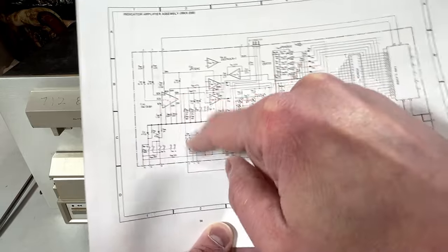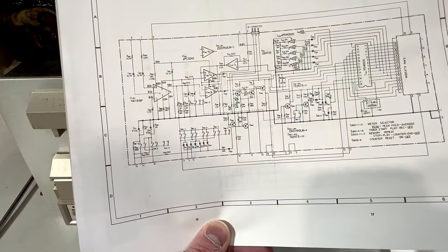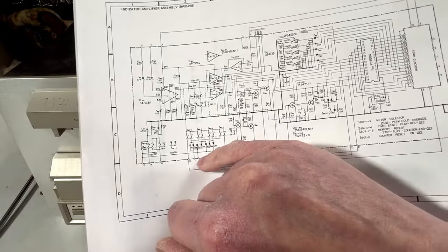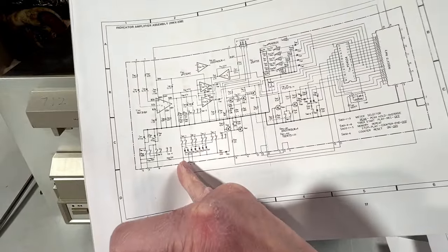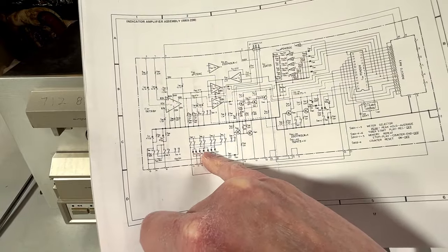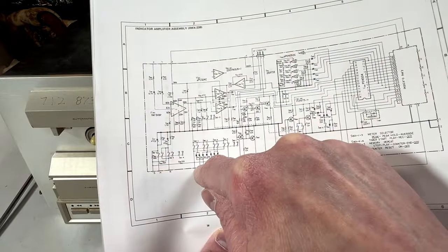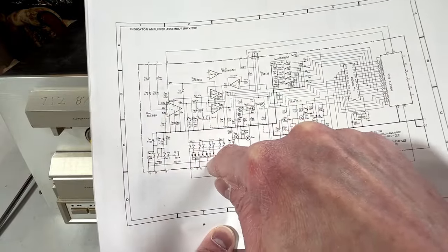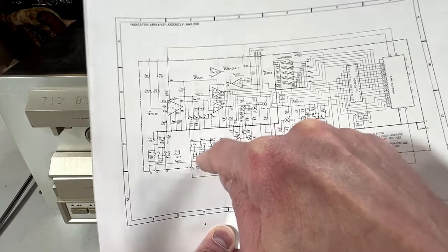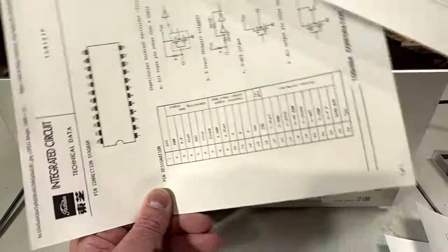The reason I'm ruling out this board is because it does go into auto-play. The auto-play comes in at pin 11, and there are 7 diodes up here. I initially thought maybe those diodes might be causing a problem, but that's not possible. If those diodes were causing a problem, this thing wouldn't auto-play either - but it does auto-play. So what is the problem?